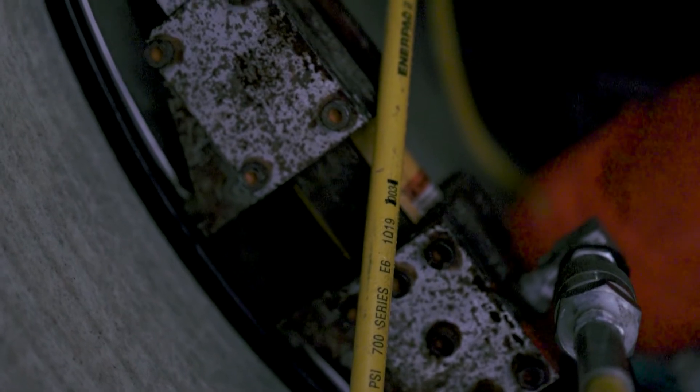As I'm opening the ring up, I'm looking around the clock of the seal to make sure it's sitting in that groove. You can see this very clearly. If the stainless steel slips out to one side, you're not compressing the sealing lips on the back edge, which in theory creates a lifted area for water to track out. So keep checking around and feel it with your hands, keeping that pressure coming on.